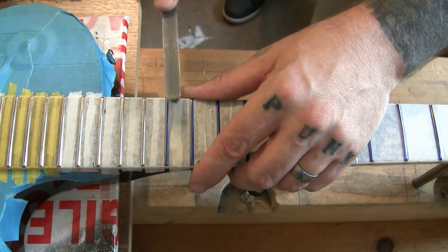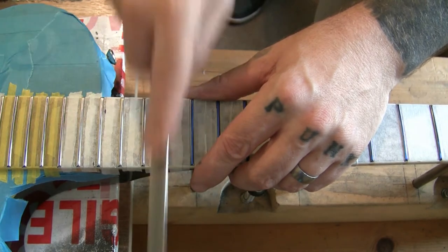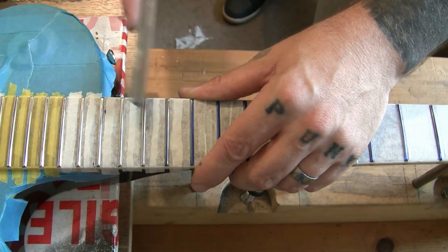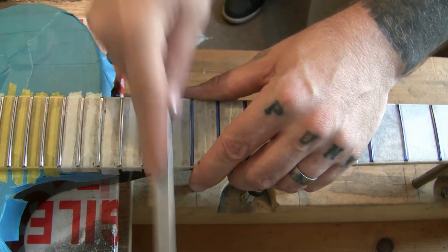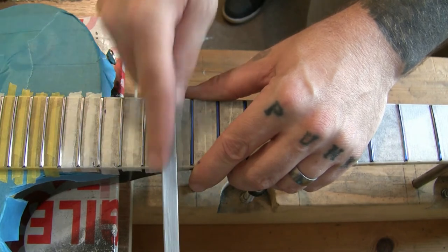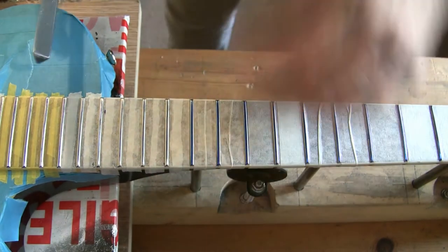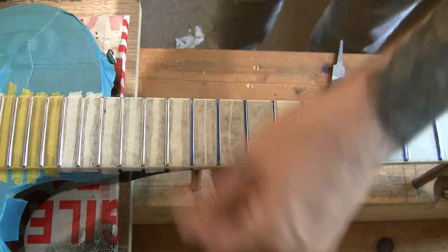I'm going to show you how it works, because I could get a file that did the work for me, but I prefer to do this by hand. You see how it's working, and I'm just leaning in more and more. All we're doing is putting that curve back in the fret. And I'll turn the file over and go to the other side. The reason I'm showing this is a lot of my subscribers on YouTube say, keep all those bits in, where you're working and showing us how it's done, because we want to learn these things. And there you go.